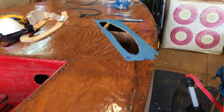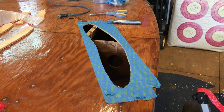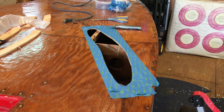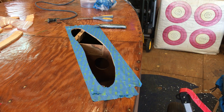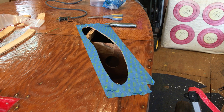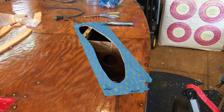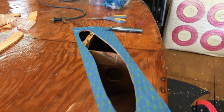We've cut out the old rotten area and we're making a pattern for the patch. By 'letterbox,' if you can envision the old front doors that had a little letter slot on them — eventually sometimes people would have those repaired when mailboxes went out to the curb. So they needed to plug that hole, and basically they'd just cut a little plug and fit it in from behind.